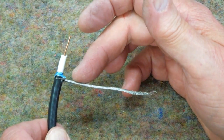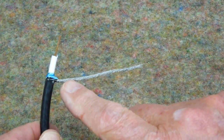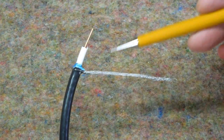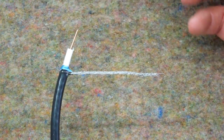If necessary we can attach this to ground. If this is not long enough we can solder right here and solder a flexible wire to it and take that to a ground connection. The purpose of the shield is to prevent extraneous signals from getting to a receiver, and by connecting this to ground we make this an effective shield for the center conductor. In my case I didn't find that it made any difference — these garage door openers don't seem to be very high tech and the signal received does not seem to be sensitive to antenna length.